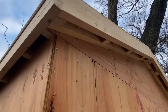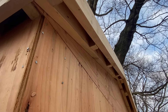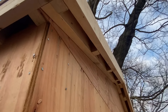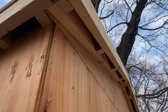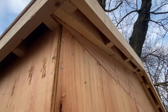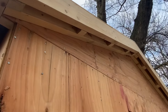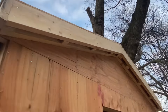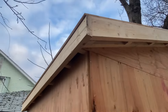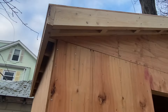The rakes were a little unconventional, just because I'm keeping it a little smaller than normal. It's a small building, so I didn't want to go out too far — it would look kind of weird. So just a board along the outside of the sheathing, then some blocking instead of a proper ladder, and then another board out on top of the blocking, all of them meeting up with the end of the sub-fascia.